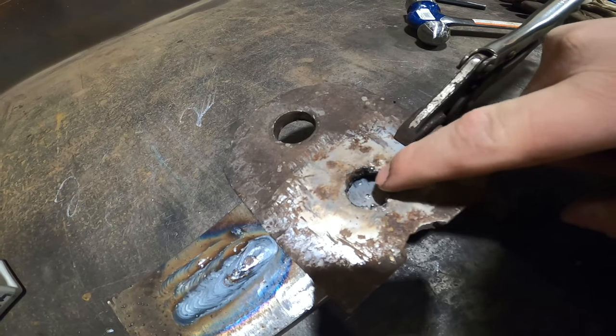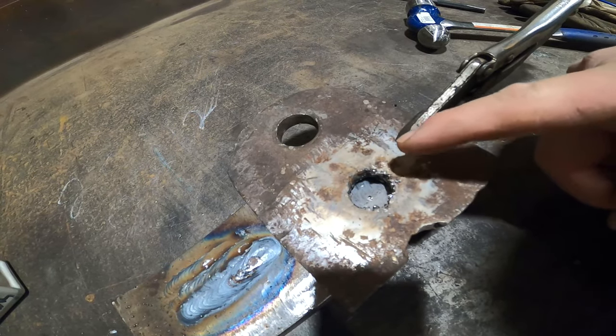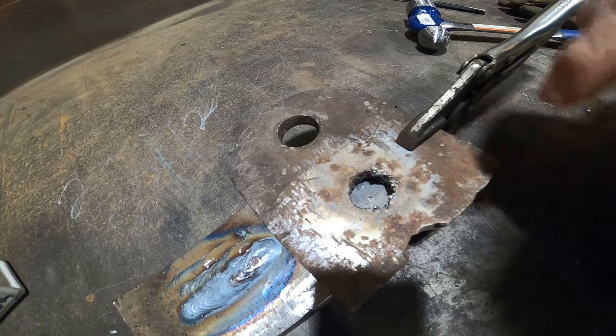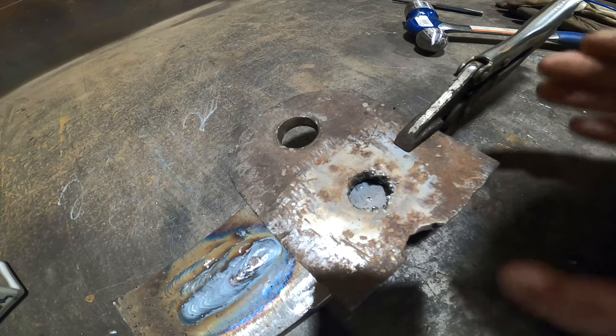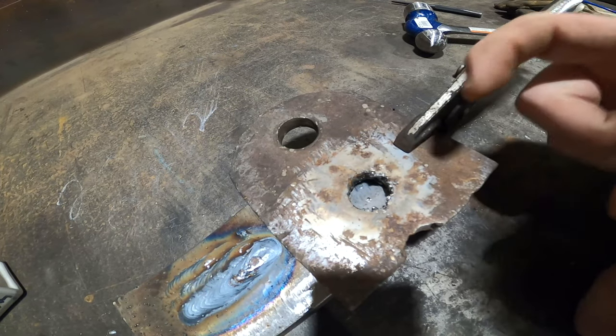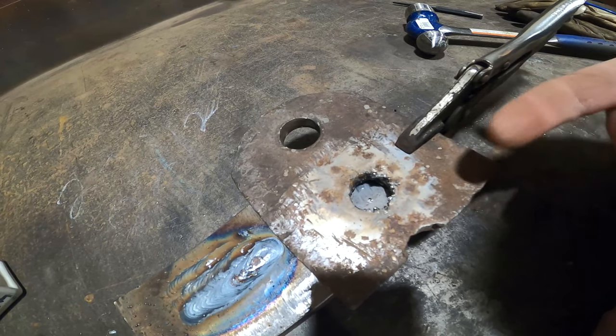This hole is actually about 7/8 of an inch in diameter and it works for 95% of them. If it's a tiny little bit too big when you're done, you can just shave the sides down with a little carbide burr and shape it and size it to fit, because I would rather have it a tiny bit big and shape it down than have it too small.